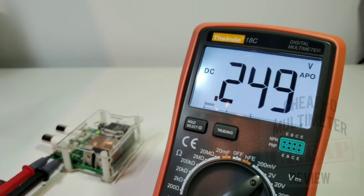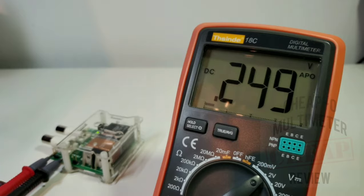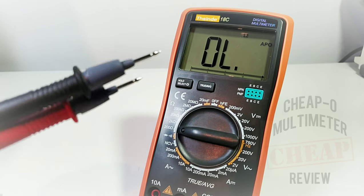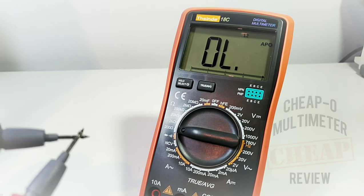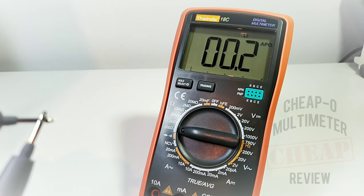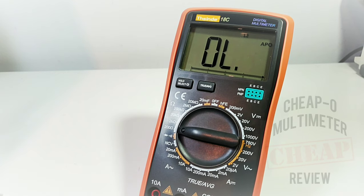We've had the voltage reference heating up for about 15 minutes and we're sitting at 248-249 millivolts — should be looking at 250, so pretty close, just not quite. Next we want to see 2.50 volts and once again close at 2.49 volts. Taking a look at resistance: these are the standard test leads and although there's no REL feature, lead resistance is 0.1 to 0.2 ohms — very minute. You can subtract that when taking measurements, but 0.1 ohm is really nothing to worry about.